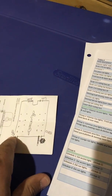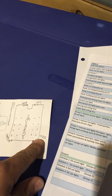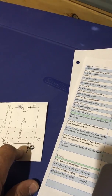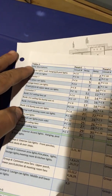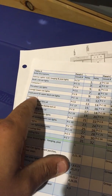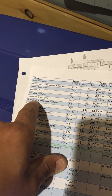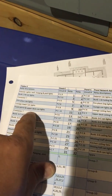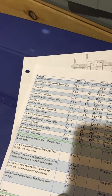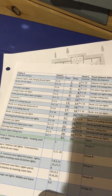I have a quick sketch of that room. This switch number here — I just reprogrammed this one, switch number 025. Currently it's turning on the lower deck can lights, the upper deck can lights, and the front porch can lights. When I go to my description page and look for the upper deck can lights, the description is 'front porch and upper deck can lights' — they're both controlled off relay number 11. So I can't have a switch back here just turn on the upper deck; it's going to control the upper deck and the front porch unfortunately.